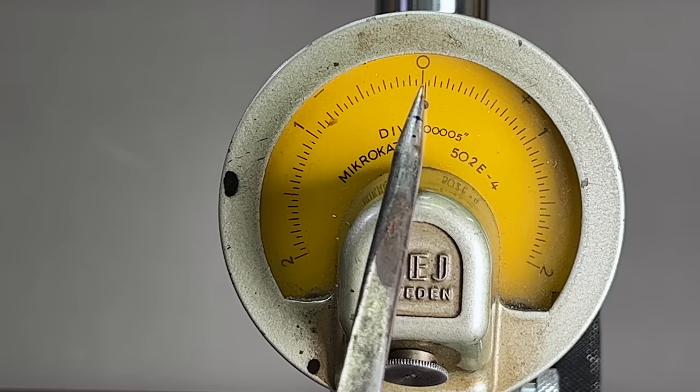This may all be within the sensitivity bubble — there are all sorts of other factors that could be contributing. But it's been sitting there, still moving, still reducing. I think it's really clear now that we've watched the measurement change while I was touching the steel gauge block. That's the reason these measurements are all calibrated at exactly 20 degrees Celsius or 68 degrees Fahrenheit.